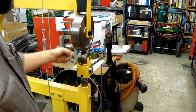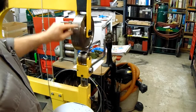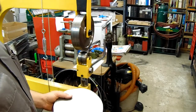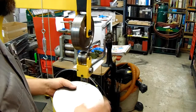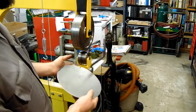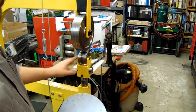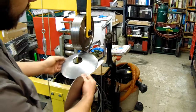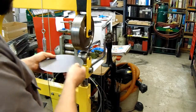And I flipped this, and it goes around the wheel, and that allows the bottom die to push up in a little bit and get more stretching action. So I could get more stretch than normal with the wheel into this piece. Once I did that, I switched to this die, which more matches the contour of this piece. And I just worked it with that until I kept working it.